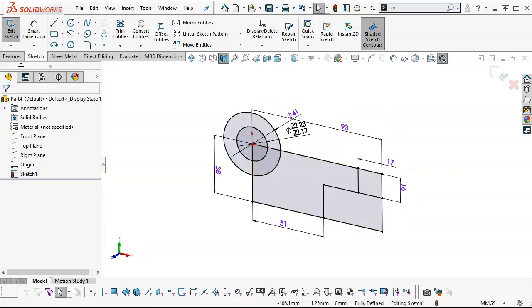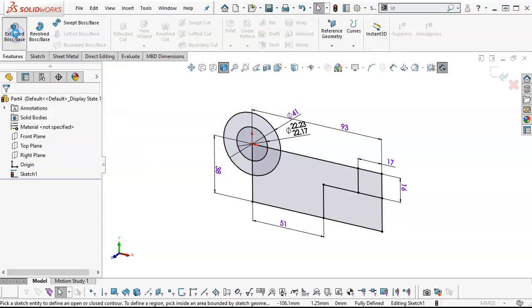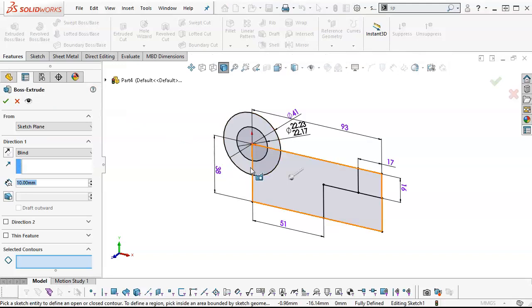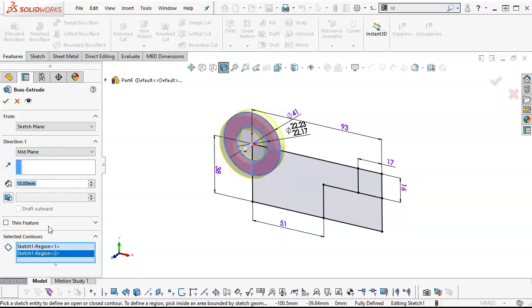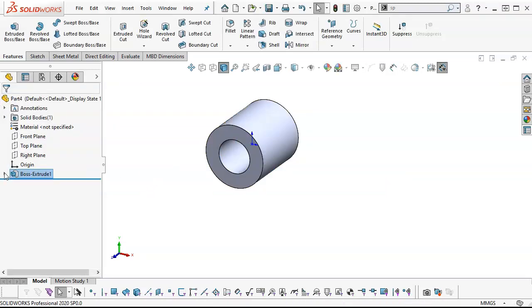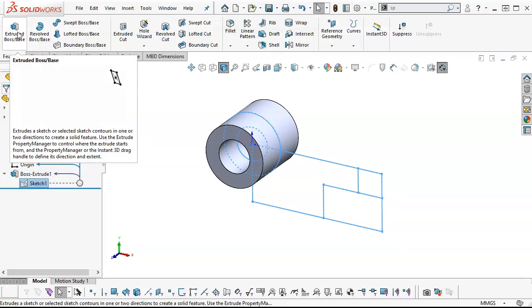let's go ahead and send this out center line. So extrude, and I'm at mid plane. We'll go mid plane to 44. That'll get me my start. If it happens to overlap or pull any of that extra geometry, it should be pretty visible that something's going on.